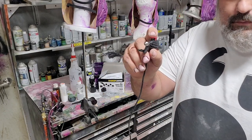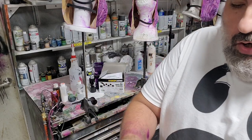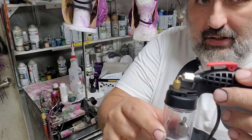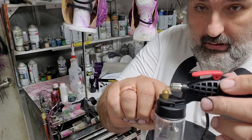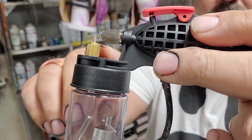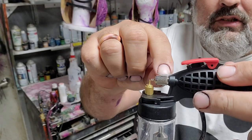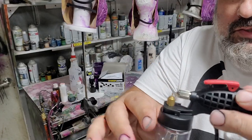I have air coming out of here. The way this works is it draws air over top of this tube — this tube shoots out the air, the paint is in here, it creates a low pressure and high pressure inside, and that forces the liquid out. That ratio between those two posts is very important. You can adjust it by screwing this one out or by screwing this one up — those two adjustments are what you have.